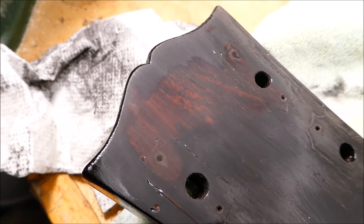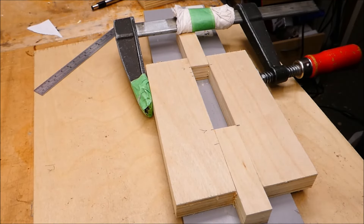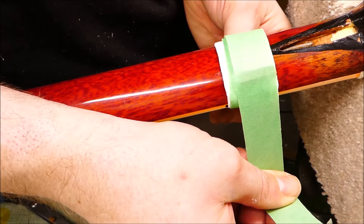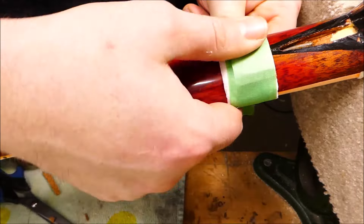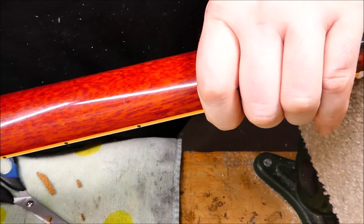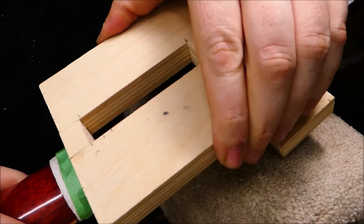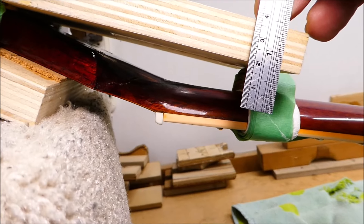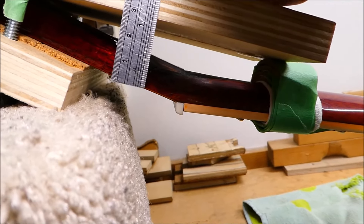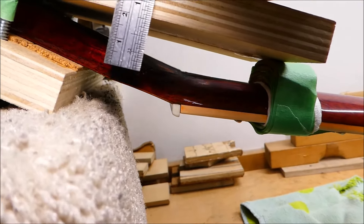Back to the cherry example — there is no serial number there, just rosewood. I need to make yet another custom jig to cut a patch for the missing wood on the neck. I glue that up out of four pieces of plywood. This is a tough angle because of the length of the chasm. I tape a pad of cork to the neck to help prop up that side of the jig and try to equalize the cut between the angle of the neck and the angle of the headstock. The jig clamps onto the headstock via some machine screws and cork pads. Here I'm checking the depth of cut I can get away with — I have to be mindful of the truss rod in there, and consequently it's not going to be all that deep. It's going to be shallowest in the center right behind the nut, which is not ideal, but them's the breaks.